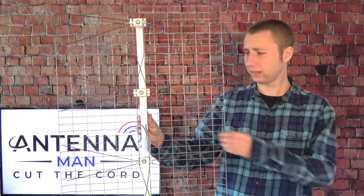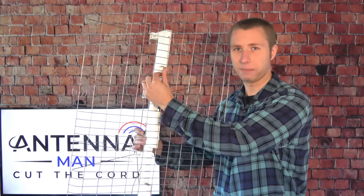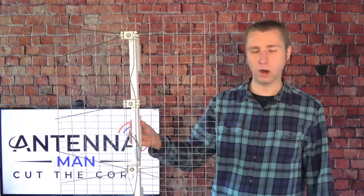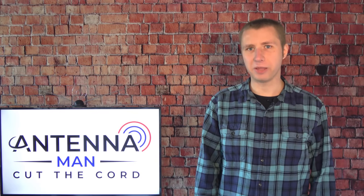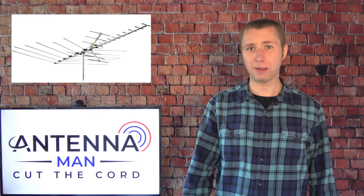It's not necessarily a bad thing — this antenna did perform better than some antennas I've tested. What I will criticize is how the balun is just soldered on — if it comes off, what do you do? I personally would have used some kind of bolt and washer setup. I also don't understand why there aren't any brackets on the back to mount it to a pole. If you have stations on the VHF band that are weak, I don't care what Danny claims — you're going to need a large Yagi-style antenna with multiple elements to reliably pick up those channels.